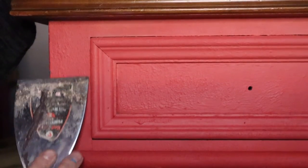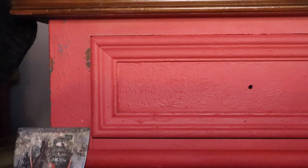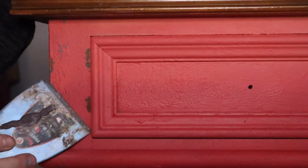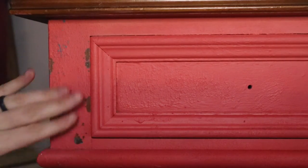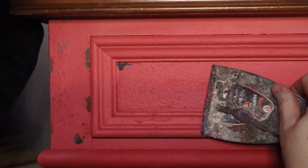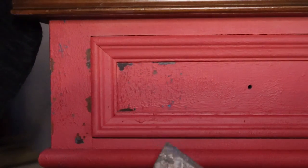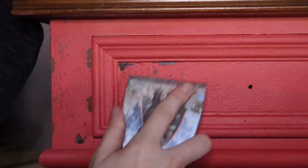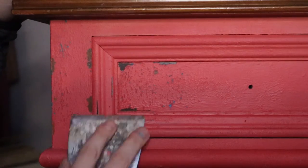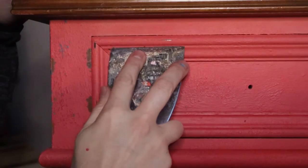Next, I waited for the paint to dry, then took a paint scraper kept parallel to the surface and added a little bit more pressure in some areas. I wanted it to look chippy but not like a mess — more of a natural wear. What this does is expose that blue Peacock color we used underneath where the texture is. As long as you keep your hand controlled, you can control how much chippiness and how much paint you pull away. Start lightly, step back from your piece, and see if you like it — you can always do more, but you can't undo it.